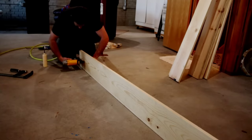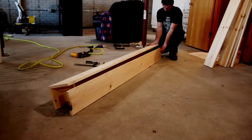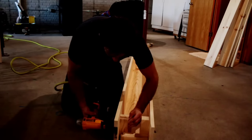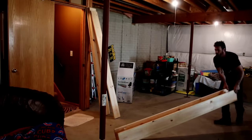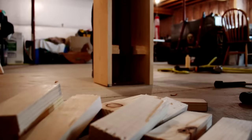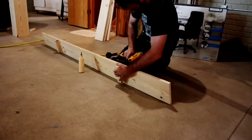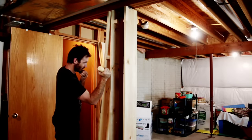The hardest part about getting the spacing correct is that you want to end up with about a quarter inch of play between the spacers and the pole — I'll show you why in a second. After connecting three of the boards together I took the entire box and lifted it into place. The first one I did was a really tight fit, a little bit tighter than it needed to be, and I ended up having to refine all the spacers before everything would fit together properly. It's best to undersize these by about a quarter of an inch.